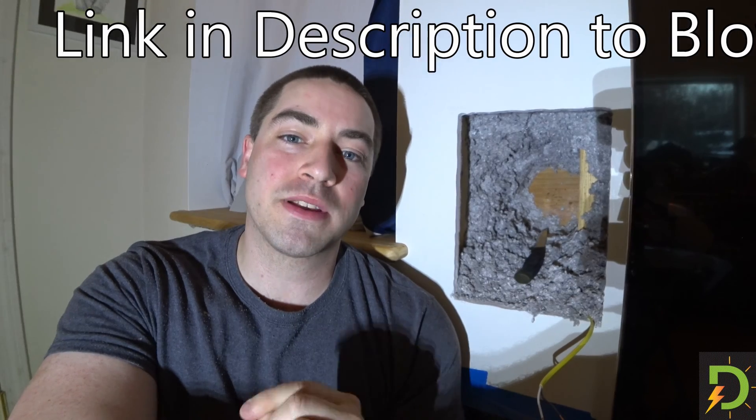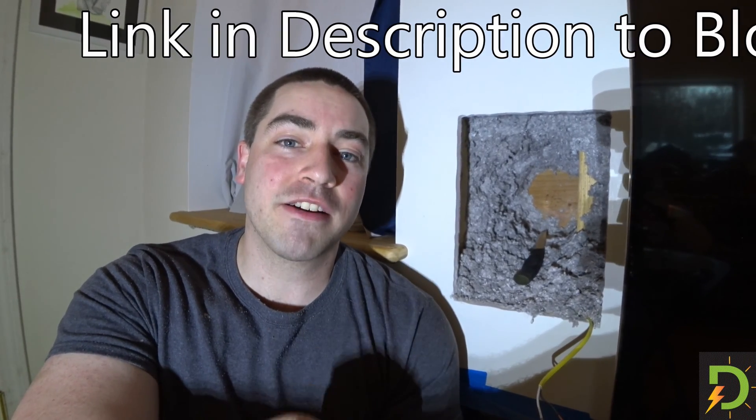If you're thinking about building an energy efficient home, the most cost effective way to do it is a double stud wall filled with dense pack cellulose. It's way more cost effective than exterior foam board, SIPs, ICFs, or any of the other options. Anybody can do this, but you've got to make sure that the exterior plane is 100% air tight. My house tested out at 0.09 ACH — air changes per hour — it is a very tight house. You have to do that so you don't give warm moist air from inside the home a pathway to reach that condensing surface. You don't need an interior air barrier if you have a really good exterior air barrier. Just one air barrier. Keep it simple. And you don't need a vapor barrier on the inside — I don't have one, and it works terrific.